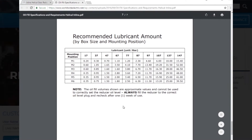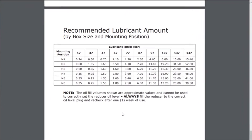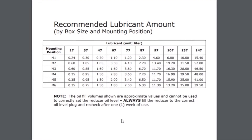If you change from an M1 mounting position, you will have to drain the oil to be able to add the proper oil level back. You will need an oil measuring container to do that, so use a measuring cup or container with ounces or liter measurements to aid in your oil additions or subtractions.